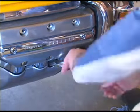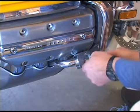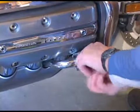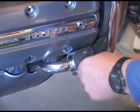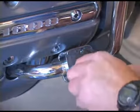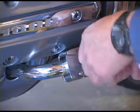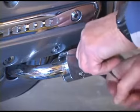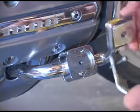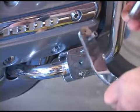When tightening the mounting bolts, do a little bit at a time on one side and then the other, so you're pulling the clamp up evenly. With the KA, KD, and KL, and any others where the peg is out, the mounting bolts need to be a little bit tighter than with the Model DD. Then the same mounting procedure as before: expose the end of the spring into the small hole of the leg.